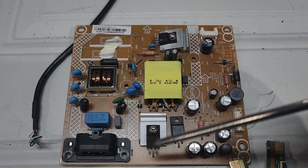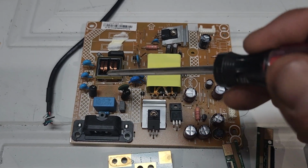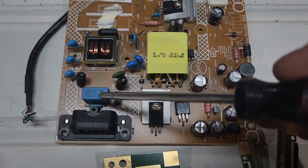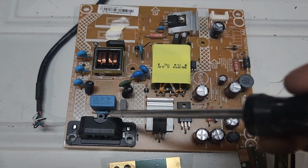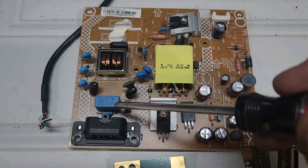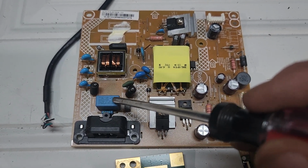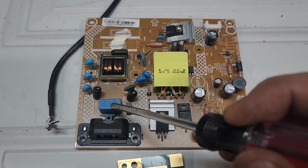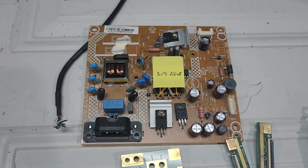You got a copper transformer here. I feel like a weatherman. It's really hard. And you got copper here. These relay boxes sometimes have silver in them, in the contacts. If they're a relay, they will have silver. If that's a thick film capacitor, if that's a film capacitor, if you take that off the board and look, and it has resin inside the bottom of it, then it's not gonna have silver in it.